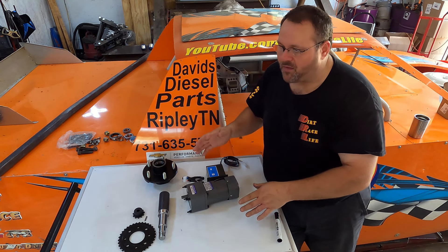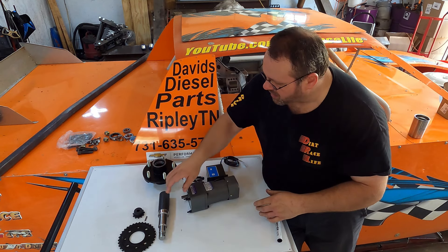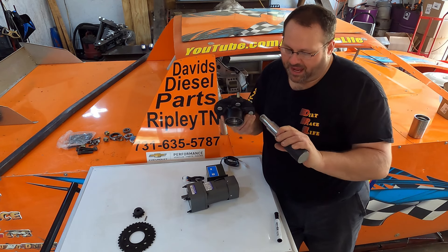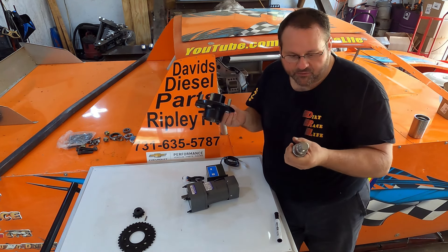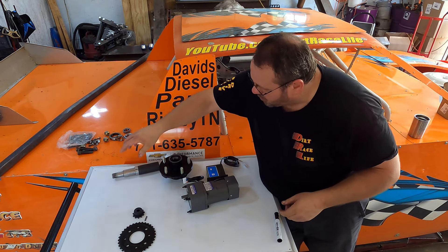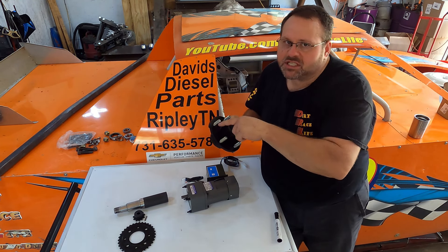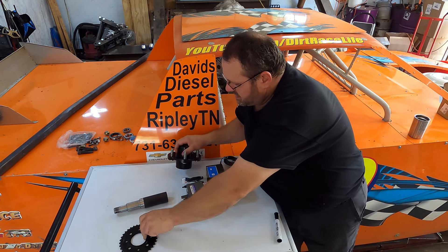For the exact details and links to all the parts, go to my website dirtracelife.com — I'll put the whole build there. Next, I went with a trailer hub and spindle — a replacement spindle and hub, five-on-five because that's what we're doing on this one. Way overrated for this purpose, but cost-wise it's about $50 with bearings and everything you need — by far the cheapest way to do this. I'm going to knock those studs out and put five-eighths in so I can use one-inch lug nuts for quick on and off. I'll only put three of the five studs in since this is just a tire grinding stand.